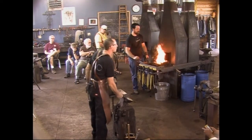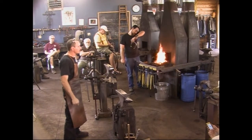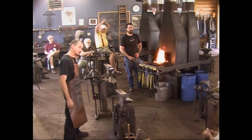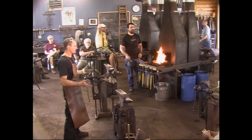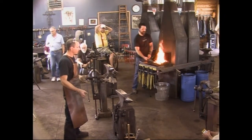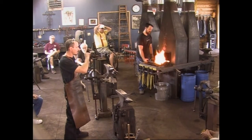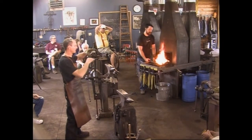James, what's the source for getting your specs? I go online and find it usually. There are a lot of sources out there, but there's one, I believe it's called Metal Suppliers Online, and it looks like just a place to register and to buy wholesale metal. But if you look, there's a place there you can type in an alloy number. It says search, you type in an alloy number, and somewhere in the list there's a place that says to view chemical and physical properties of this material, click here, and they'll pop up and it'll say forging.